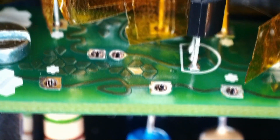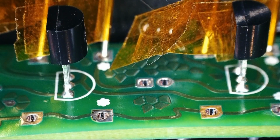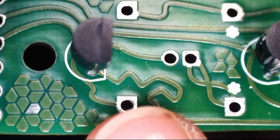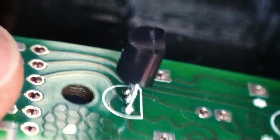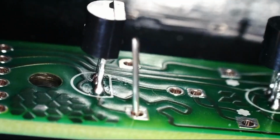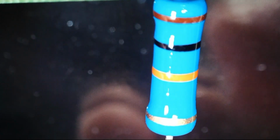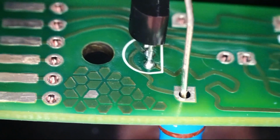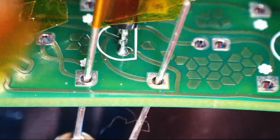Let's populate the resistors on the correspondingly meshing side of the other board, since that's where we can actually tell which one goes where. There's the 10K resistor pull-up, and then the LED current limiting resistor, 150 ohms, and then 10K, 150, and so on. Let's make them consistent and have the gold stripe toward VCC on both sides. But, oh man, the chemical plating on a typical manufactured PCB is so nice. It would be interesting to try to do that at home. All these little flag things sticking out.